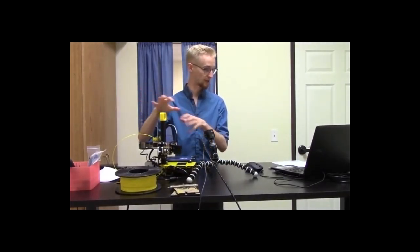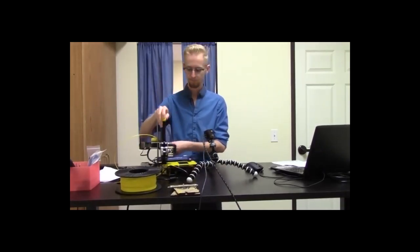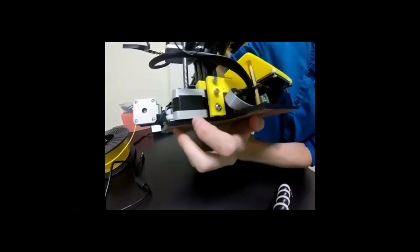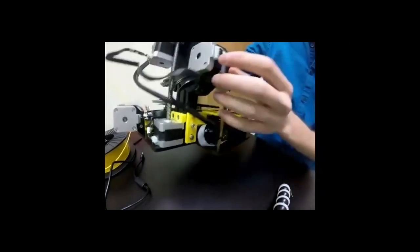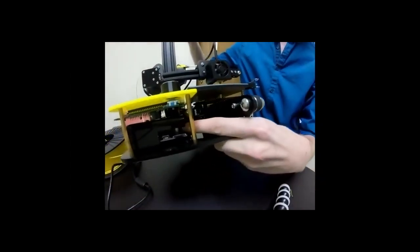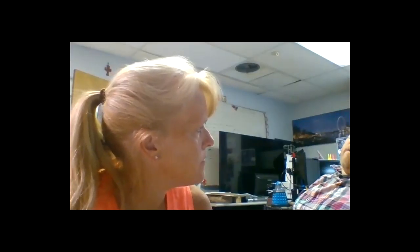The frame may wiggle a little bit and that's just the movement of the motors — it's okay and it's not going to affect your print job majorly. If you personally feel it wiggles way too much, that is something we can adjust and you can always send a support ticket to us. Also make sure the Z-axis motor is completely flush to the build plate — that is something that can happen and if it's not it could cause serious problems. Check your motor inputs, which connect inside this area here.